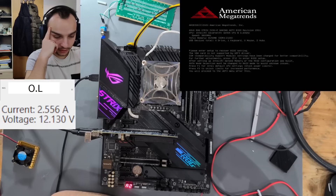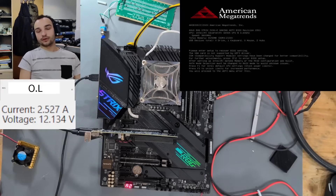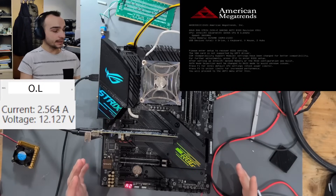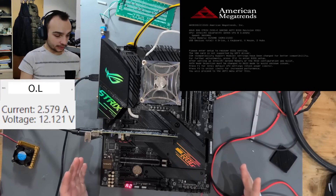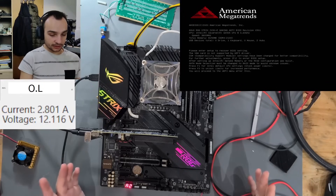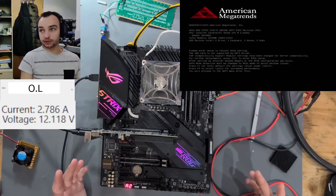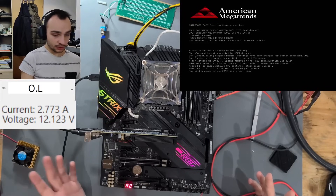There's the possibility of replacing individual pins on a board like this, but that requires a really good preheater because this is a very big, high-end board. When you take all the coolers off you need very good preheating to not melt the socket and to get individual pins out. It definitely is possible but really not easy — I've done it before on boards with not as much heatsinking, not that many layers. This board can definitely be used in a single-channel RAM configuration, but sadly not dual-channel.